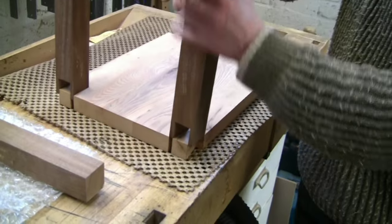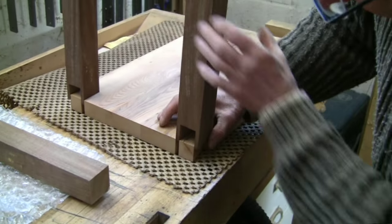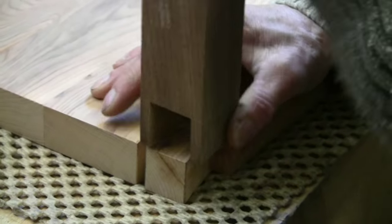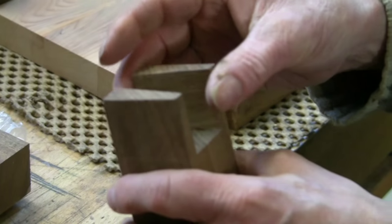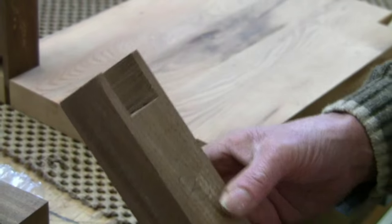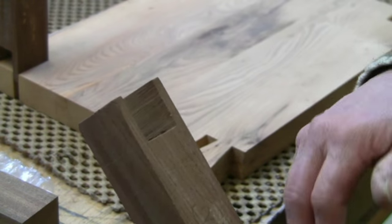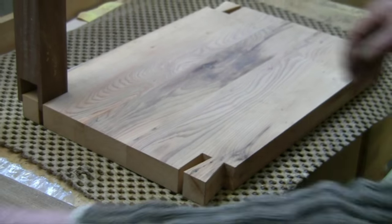On this occasion I'm having to give it some attention after we've sawn it. We can see this one is a little bit tight, and I think what we need to do is just ease this off a bit on the sides with a paring chisel, just to make it enter a little bit more easily. Ideally, to save time and for high craftsmanship, these should fit straight from the saw.